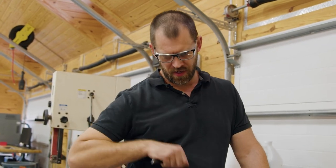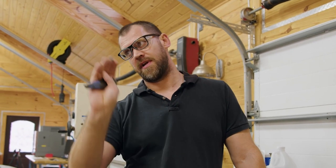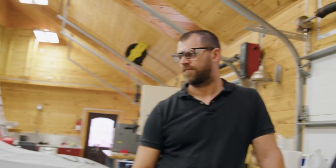Keep a simple log — write down the knife and the angle you used. Next time you come back, set your equipment to 21 degrees and sharpen back to that same edge. You're not taking excess material. You only need one or two passes — not five, six, or seven. On the Wicked Edge, take one pass and see where you are. That makes sense — in instructional videos I've seen people say to do it ten times, but I don't want to remove material unnecessarily.